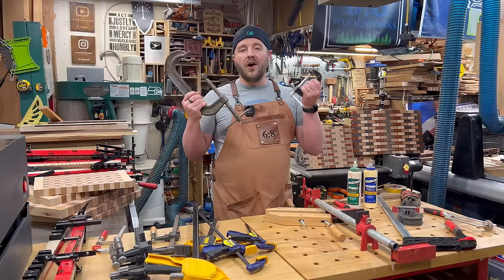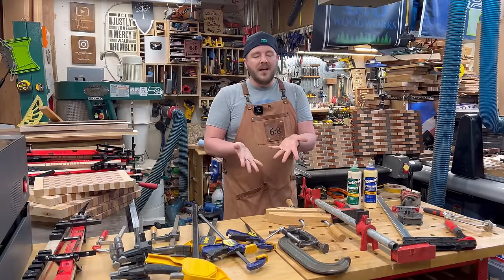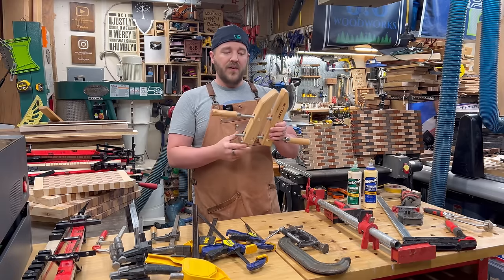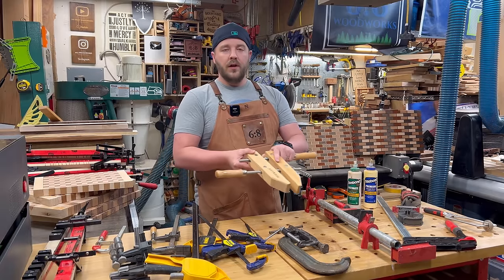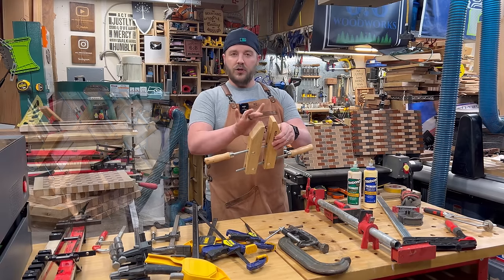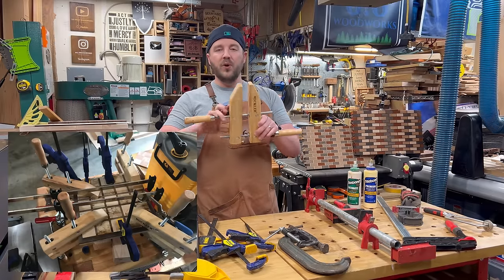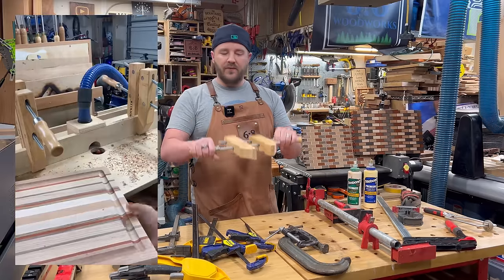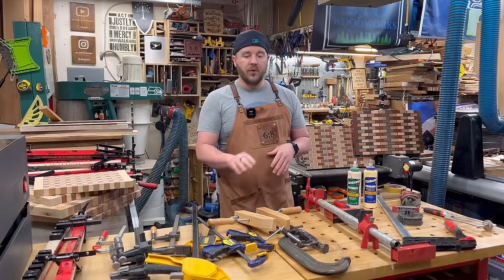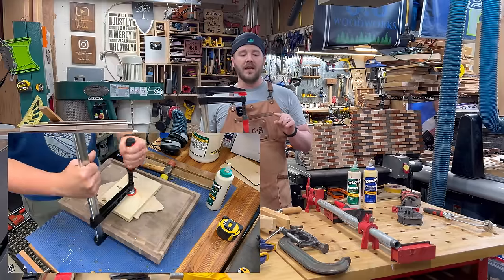This massive C-clamp — C-clamps really aren't necessary for woodworking; it's more for machinists or metal work. There are some applications but I rarely use them. This one here I actually use a fair amount — it's great for holding pieces together, can do stuff at the router table, it's a stand, and it can do a lot of other things. It has longer jaws so there's a deeper reach, helpful if you're trying to close a gap and get things flush. Wooden screw clamps are kind of handy and fun to mess around with; there are some great YouTube hacks for using them.